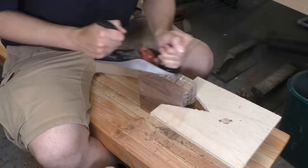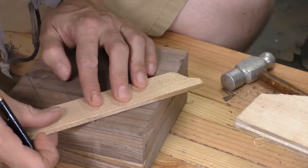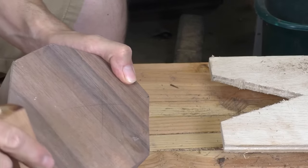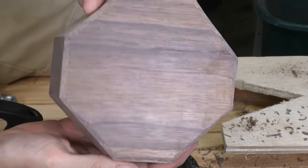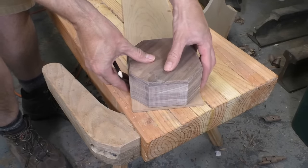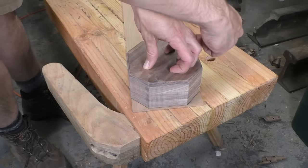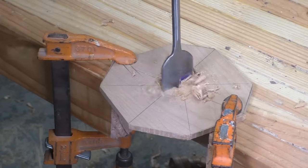By now the glue should be dry on our hub piece and we can get to work on that. Square up the wood, then mark lines across the corners. Saw these corners off and plane everything smooth until you have a nice even octagon shape. Use a marking gauge to lay out a line about a quarter inch in from all the front edges, then plane a bevel down to that line. That's going to make the front edge of your hub smooth and make you unlikely to bang your knuckles or knees against a sharp edge. You're also going to need to make a hardwood spacer to go in between the vise jaw and the jack screw plate. Just cut it to the shape of your hub and then bore a hole in the middle.